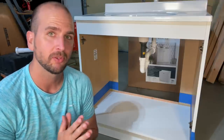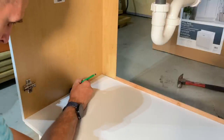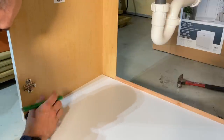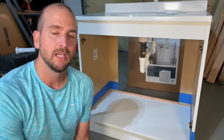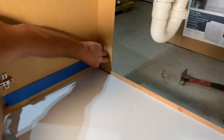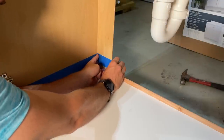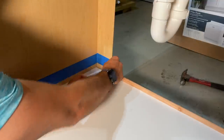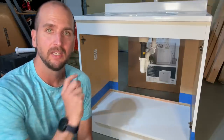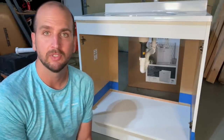Once the lath was in place — about three-quarters of an inch — I took a roll of electrical tape, which is about the same height, used a pencil to mark the walls, and that became my guide for the painter's tape. I put down two layers of painter's tape as a barrier so the Flex Seal overspray wouldn't get on the side walls. If your sink base already has a back, just put painter's tape on that back side for a three-quarter-inch lip all the way around.